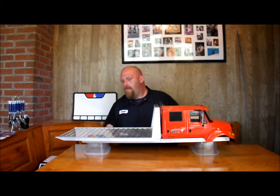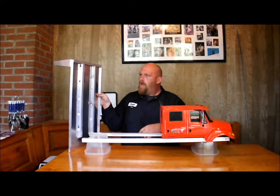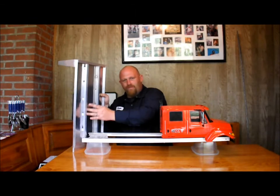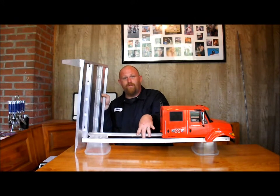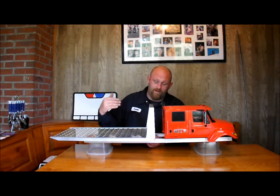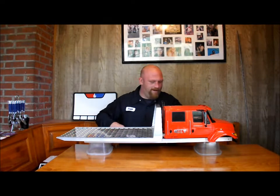I've been looking at the rollback I drive at work. I'm gonna run angle iron inside of here so it sticks down — that's what the bed is actually going to ride on. It'll be a carriage that sits still and the bed will slide back and forth on that. I'll mount two servos to linkage, and as they turn the leverage, I can tilt at any point in the bed travel. They'll also double as a bedlock setup like a rollback has, so when it comes all the way forward it can't start bouncing.